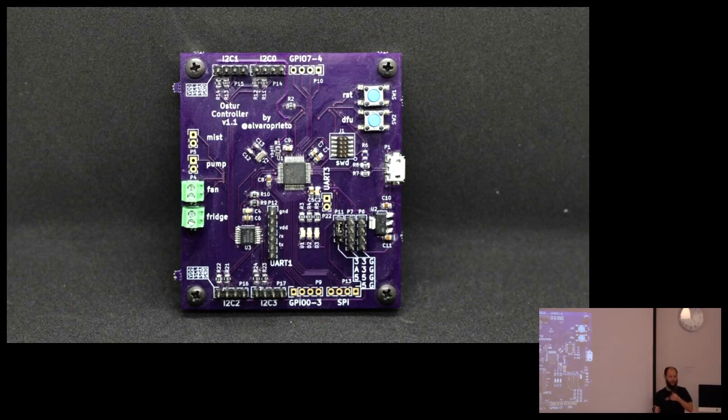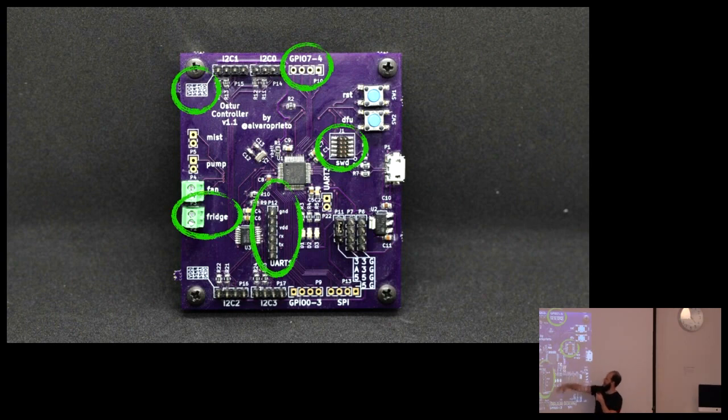Okay, so version 2, I realized I didn't need that many channels. It was huge. I fixed these guys, as you can tell. Now the label is correct. I labeled my UART pins. I labeled here, you have voltage, SCL, SDA. So now it's kind of more minimal, but it's actually labeled, so it's useful. And I have the standard ARM 10-pin connector. So that was kind of nice to have.